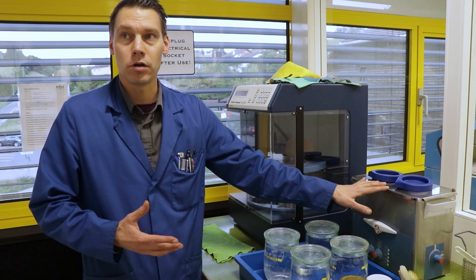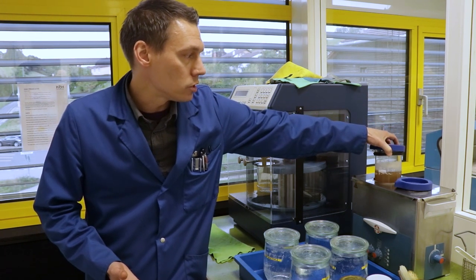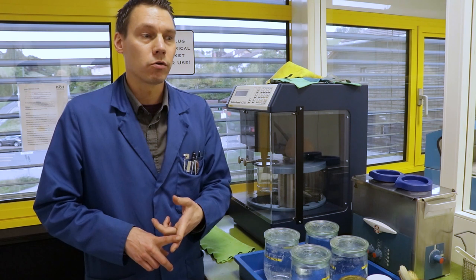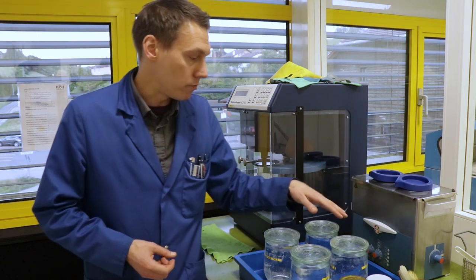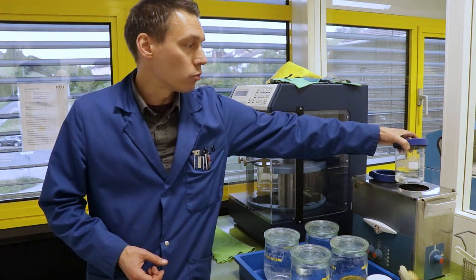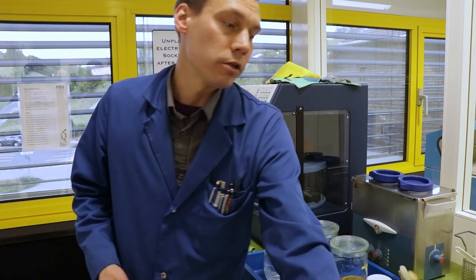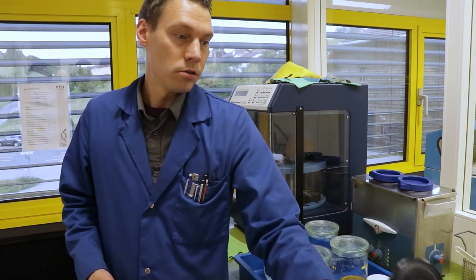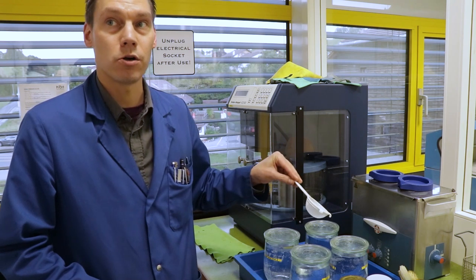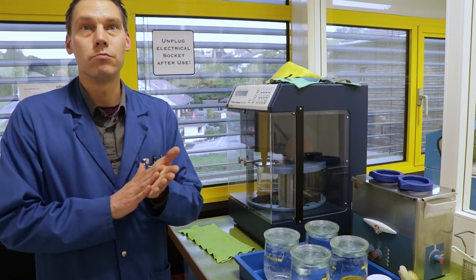This one here is just a general ultrasonic tank with cleaning solution. They use RG1, which is a general watch cleaning solution — you can also use it for clock cleaning or cleaning bracelets and cases after polishing. Then they use tap water for removing the cleaning solution, and then isopropanol to remove the tap water. Then you use either a hot dryer or a regular hair dryer to heat it. They have plastic tea filters so that parts don't get scratched, whether you're cleaning a full movement or single watch parts.